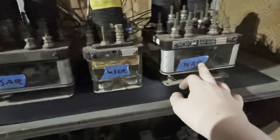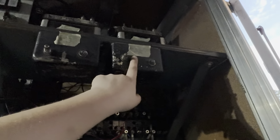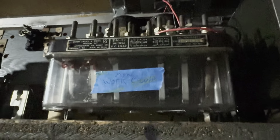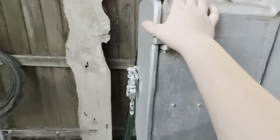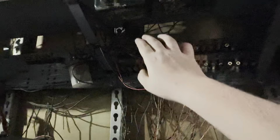Here are the approach relays for north, east, south, and west, and the signal-clear relays for north, east, south, and west. Here are the northbound and southbound emergency release buttons, and here are the westbound and eastbound emergency release buttons. That's the maintenance-of-way work equipment relay — when its key switch is turned, it drops all signals within interlocking limits to stop, providing complete protection for MOW equipment to get on the track. There's also another emergency release box out here.